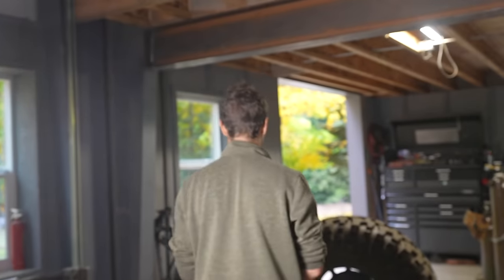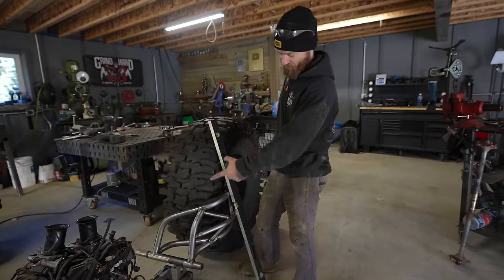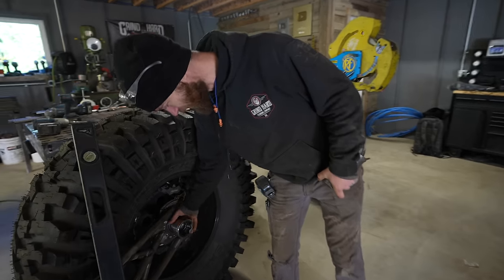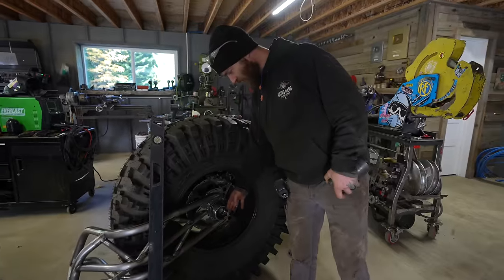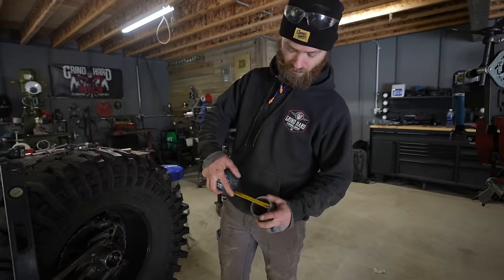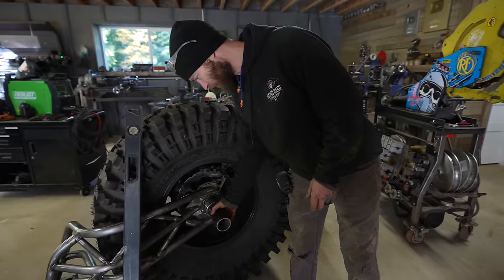Yes, that's the truth. I ordered up a bunch of parts for the jack shaft and bearings and stuff, because I'm gonna need that as we start building forward on this thing. But in the meantime, I'm gonna figure out the chain drive back here. Currently what I have is a CV cup axle stub, which I need to attach to there. But the sprocket needs to be about 3 inches out from that point. So I found this chunk of basically 3-inch round tube that will be more than strong enough to hold a couple inches of chain extension.